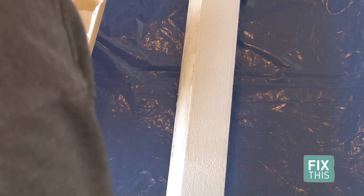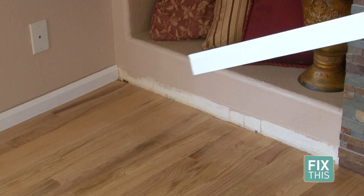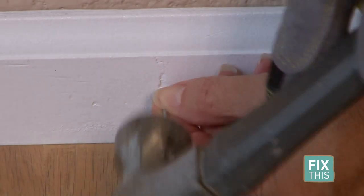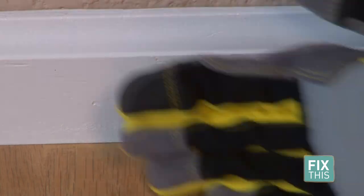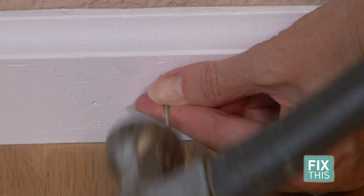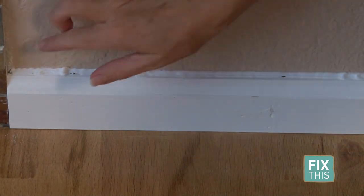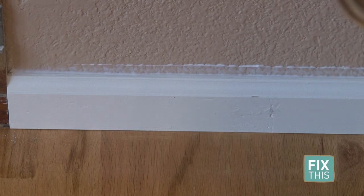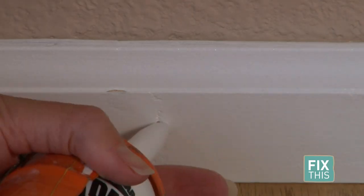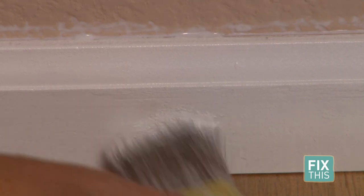Now it's time to paint. Over a drop cloth, use a small roller to paint the baseboards. Let that paint dry and add another coat until it's covered the way you like it. Once the baseboards dry, nail them back into the wall. If you don't have a nail gun, hammer in no-head nails and use another nail to tap it in past the wood. Now use caulking to finish it off at the top. Run your finger over the caulking right away to make sure you have a smooth seam to the wall. Put caulking over any nail holes and then cover that with a little paint.